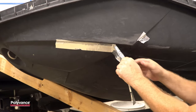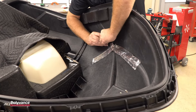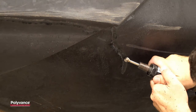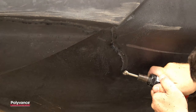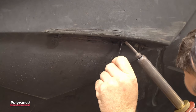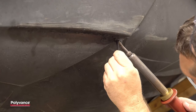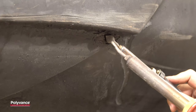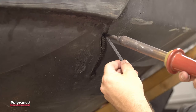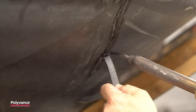With the welds on the inside completely cooled, we will peel the tape off the outside and get it ready for repair. We will recycle the aluminum tape and apply it to the inside to help support the area while we weld on the outside. V-groove again with the carbide cutter bit along the cracks about halfway through the plastic, then weld using the same technique along the crack. Here we start by using the O5 profile wide ribbon, applying as many passes as necessary to completely fill the v-groove. We started with the wide rod, then made a couple of passes with the O4 profile medium width ribbon, and capped it all off with a final pass of the O5 profile wide ribbon.